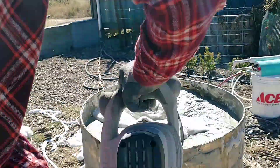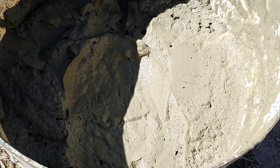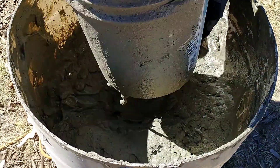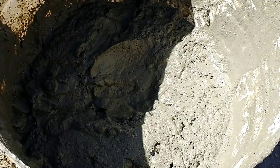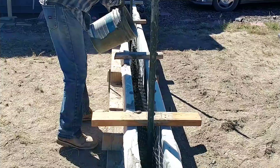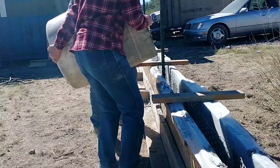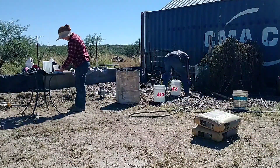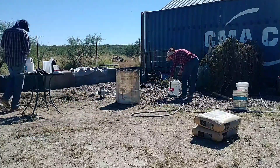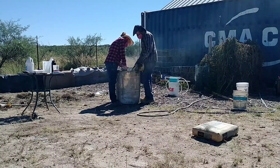Making a full batch is a lot different — you can see we're filling pretty close to the rim. I cut this barrel down to just about an inch above what it needs to be to hold 45 gallons, so we filled to the top, mixed for a while, and it lowered a little bit. We're dipping the aircrete out of there — it looks a little more bubbly and aerated than might be ideal, but it looks fine. We decided to pour four batches, figuring that would fill it to about three-quarters height — a pretty deep pour of around 18 inches.